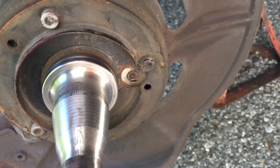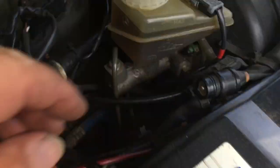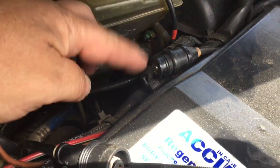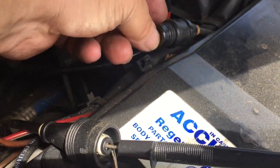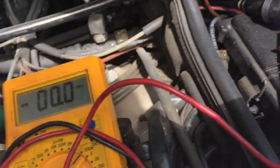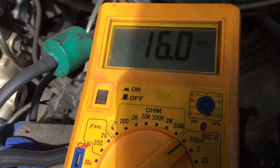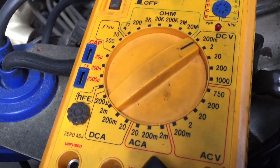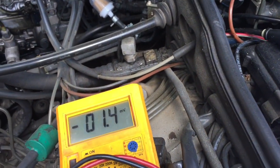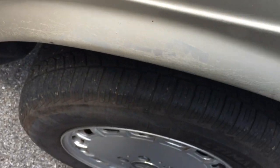Here is the driver side ABS sensor — it's located right here. There's a zip tie, sometimes pretty crusty and breaking, but not on this one. This wire goes to the controller and this end goes to the sensor. You need a multimeter; set it so you can measure millivolts. When everything is set you should have somewhere between one and one point seven millivolts when you give the wheel a good turn.